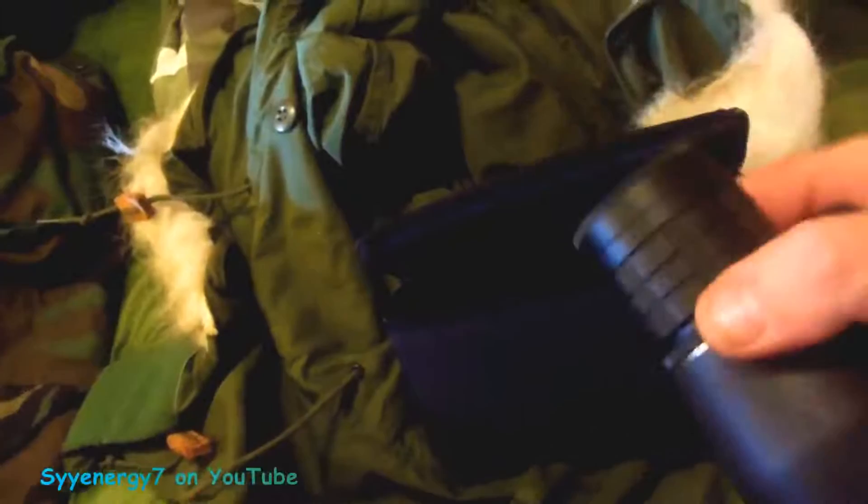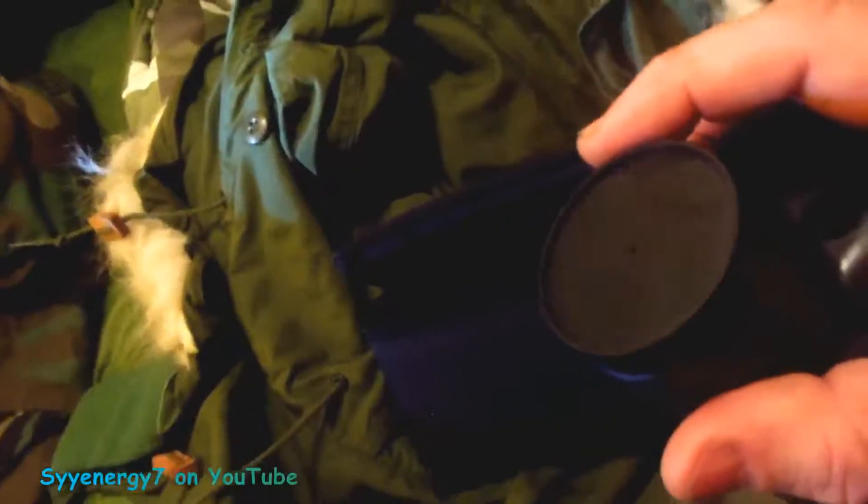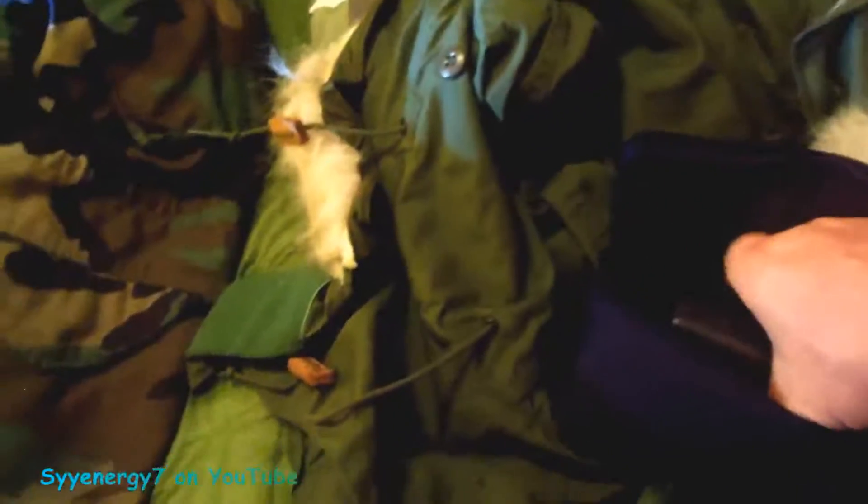Then you only need to adjust the distance control going forward. And never have the cap off with the unit turned on or recently powered up — you'll burn out the optics. I bought this in 2003 and it's now 2017, so it's 14 years old and still working great. I'd say I got my money's worth out of it.